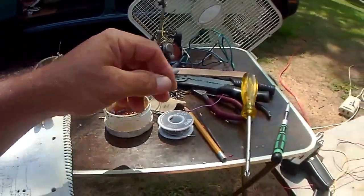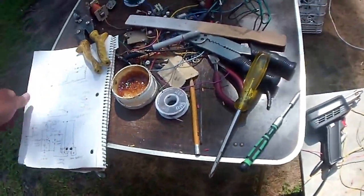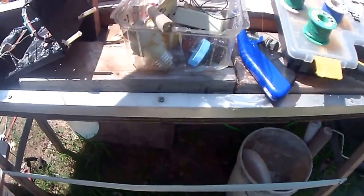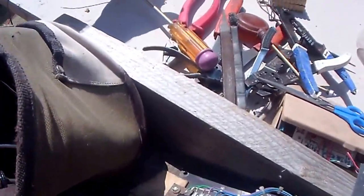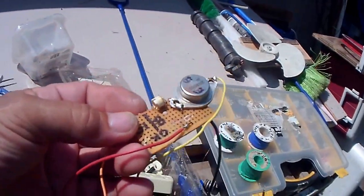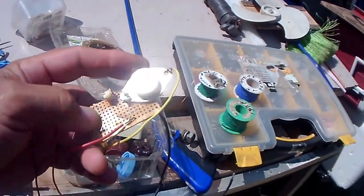Right now I'm just checking out my modules that I built for the trigger and the charge coils. They're right here. I have four of them I built today. This is what the average one looks like — there's a little potentiometer, 2 to 5K, and the 2N3055.